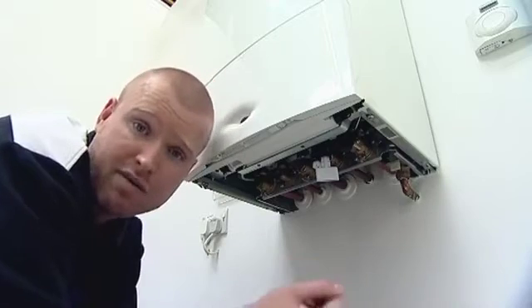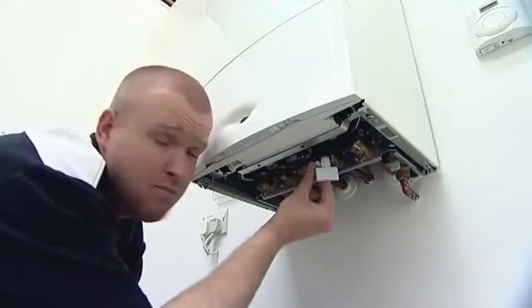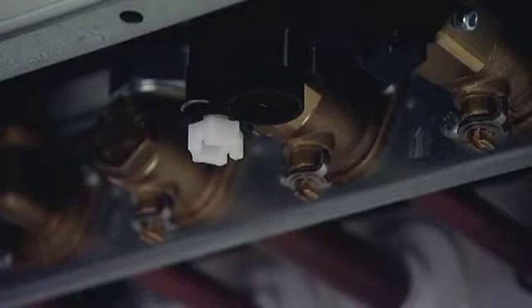If you do find, however, that the water does continue to come out, then do make sure that this spindle knob has been tightened up properly. So I'm now going to remove the key — and as you can see, just a few drips of water. I've now re-pressurised the boiler and I'm happy that the black needle is up in the green to the required 1.5.